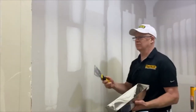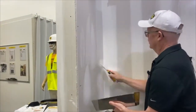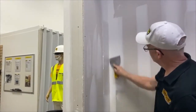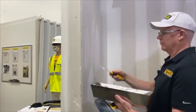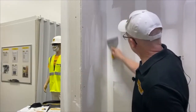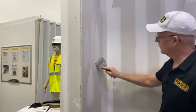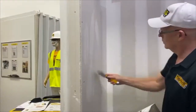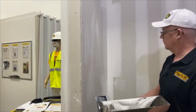For the smaller blades — I'm going to jump in this corner. I'm using a five inch knife here. We use taping tools mostly for these things, but there are corners that you have to do by hand. If we're doing a soffit or a corner somewhere — we all hate when the trash gets in the mud. It just feels good. The blade is nice and smooth, no edge, feathers nice. Right out of the bag with a new knife, sometimes new knives you have to break them in to get that feel. But to feather, if you're spotting screws, it just feels like it has support, has that rubber grip — that soft grip feels really good on the hands. Just a good feeling knife, I really like them.